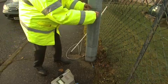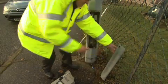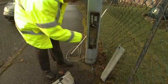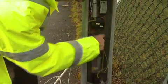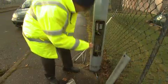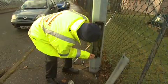Have a good look inside. Does any of the wiring appear dangerous? You are looking for exposed conductors, burning, damage, infestation or growth. If necessary, have a clean-up with an insulated brush. But be careful — there's a lot of potential short-circuit current knocking about in a simple street light.